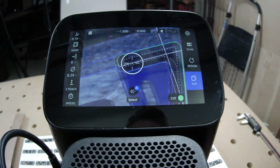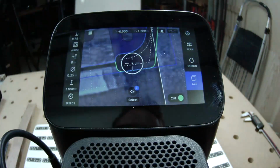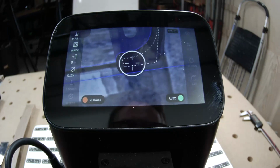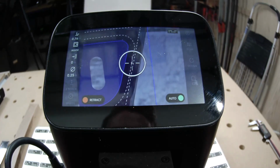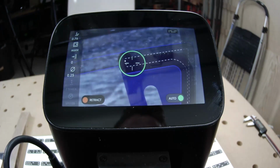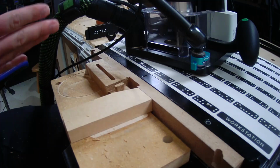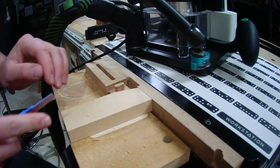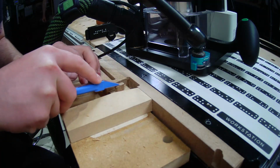One cool thing that I know Leah did for this project as well is build in some joinery offset, similar to our box joint setup, where in programming a box joint on Origin, you have a glue gap, which you can calculate as needed to give just a little bit of gap between every finger of the box joint. Leah did a similar thing here and pre-baked 5/1000ths, I think. You can correct me when we're done with this little cutting section, but I think it's a 5/1000ths gap so that it's much easier to join this mortise and tenon, or the half lap joint. Yeah, that's correct. What do you say, Jake? Can I come back? You can come back. All right.